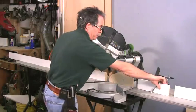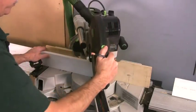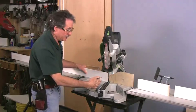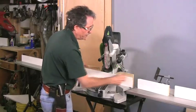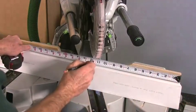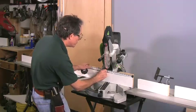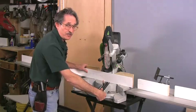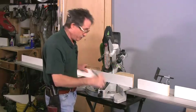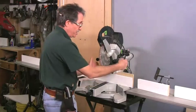The next cut has to mate with that miter, so I swing the saw to 30 degrees in the opposite direction on the other side of 90. Then I flush up the short point of this piece — it's an outside corner, so short point — and pull that measurement again at 12 and 11 sixteenths. I have to change the angle of my miter saw because we're going back down the pediment to the 15 degree angle, so I pull my saw to 15 on the same side of 90 as that 30 degree cut because these cuts are kind of parallel.